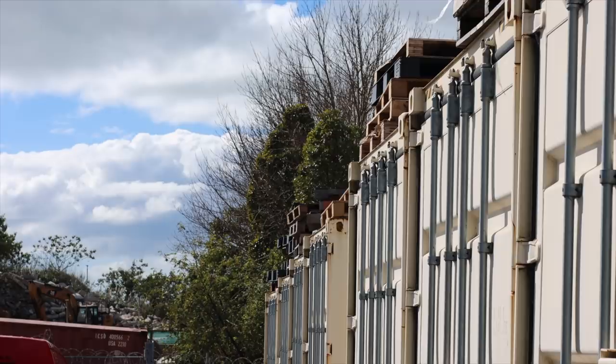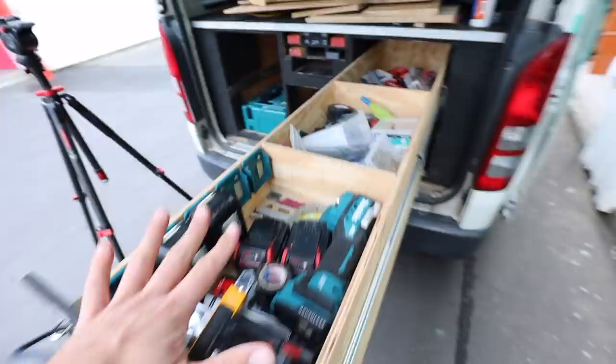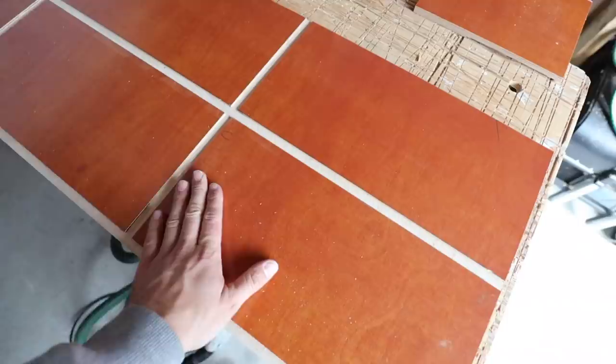Problem with this drawer. If you look at this here, all I've done is butt that ply into that ply and glued it and screwed it, but it's only butt in. So what happened is, this is quite a big drawer. So you pull it out with this, but then when you want to get to the back, you tend to grab whatever you can to pull it out further. The constant pulling of this broke the divider. I've relied on butt joints when I should have checked it in. And that's what we're doing here.